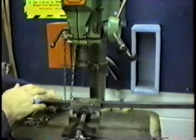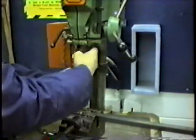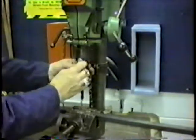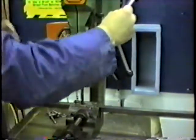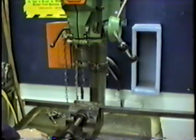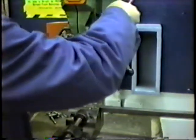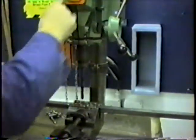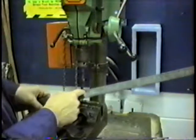Now I'm going to change drill bits — I'll take this one out and put the half-inch drill bit in. The capacity of this chuck is a half inch; that's the biggest drill bit it's going to take. I have some drill bits bigger than a half inch, but the shank — the part that goes in the chuck — is a half inch. I'm going to tighten this in and line it up right on top of that pilot hole. Now usually in steel we use something called cutting oil — it's not normally out because we do very little drilling in metal, but if the metal were any thicker I would want to get the cutting oil out. And there we have it — now these chips are hot, you could burn yourself. Notice I had to hold on to the workpiece while it was drilling, but now we have our half-inch diameter hole in a piece of steel.